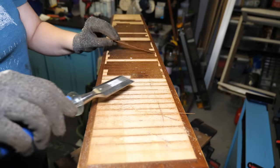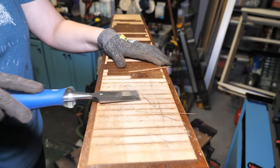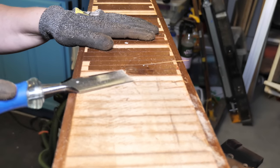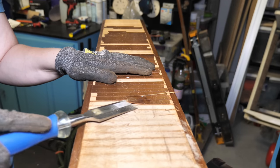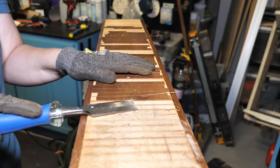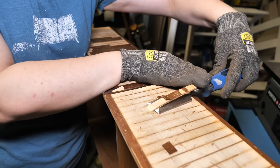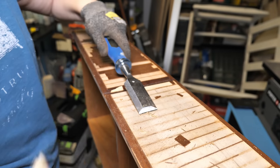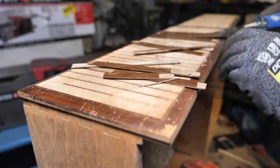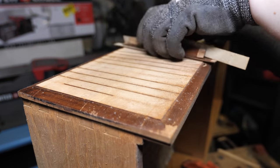While the stripper is marinating on the dresser, the damaged fluting on the front drawers needs to be removed. I'm using a chisel to just wedge under the veneer and pop it off the fronts. Fluting is very popular for furniture right now, and probably when this dresser was also manufactured. But these are really damaged, and the effort to save them would have been quite a lot. However, I am thinking of replacing them with something similar.